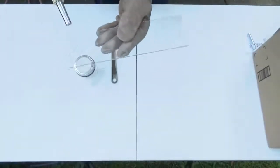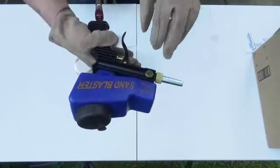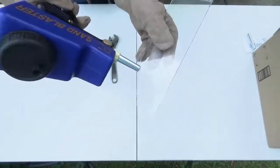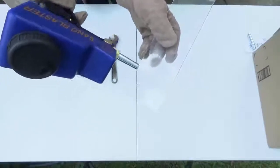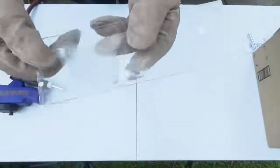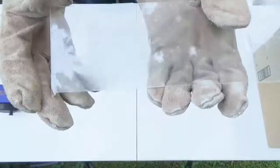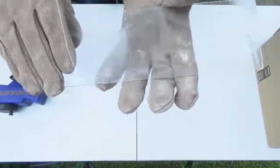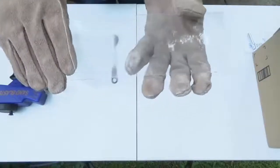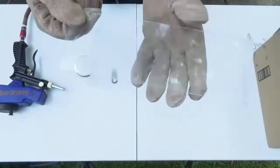We're going to hit it right here and see what we come up with. Here we go. As you can see there, did a real good job of blasting the material. So if you lay vinyl on top of this — I have a vinyl plotter — cut out your design on the plotter, paste it down, sandblast, and it only frosts what you need it to frost. So it works really well on plexi.